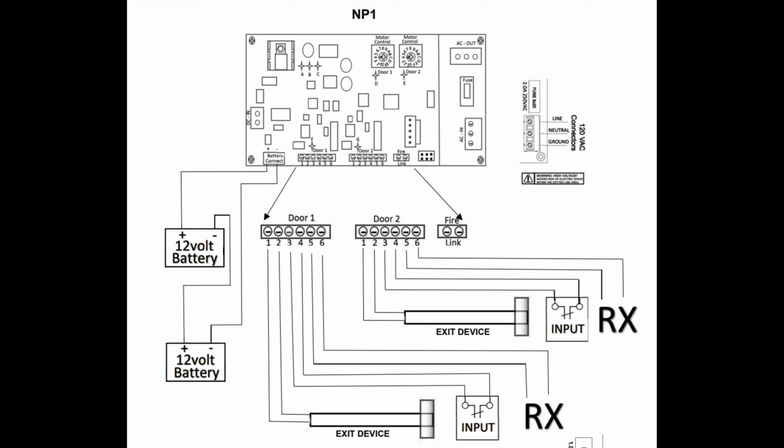The score is 1 for installation instructions, 0 for the way the guy installed it originally. And the funny thing is, there's a good PDF online that explains it exactly. Oh yeah, the wiring diagram for the MEL couldn't be any simpler. 1 and 2 go to the device, 3 and 4 go to the switch, whatever your trigger input is, whether it's an access board or whatever. So your access control relay, the brain box, you just wire to 3 and 4.